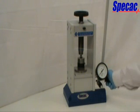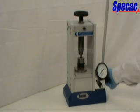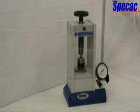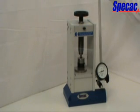Rotate the pressure release handle clockwise until it becomes firmly tightened. This closes the pumping system in readiness to build up an oil pressure in the system by hand pumping via the press handle grip. Ensure the front and rear safety guards are lowered and start to pump the press by pulling and pushing gently but smoothly on the pump handle. The correct leverage and force is applied by holding at the rubber handle.